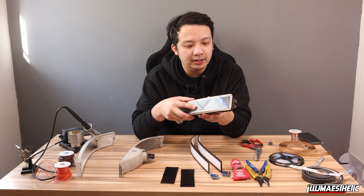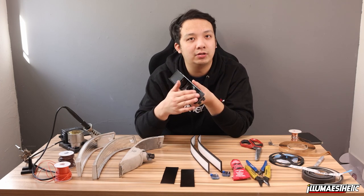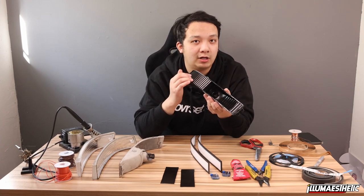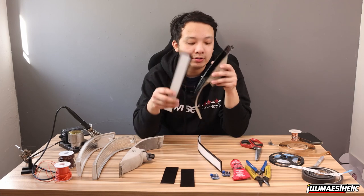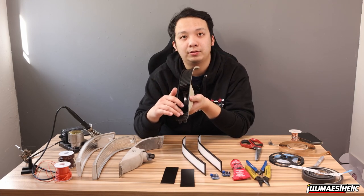I've already done the prep needed, and what is that? I basically scuffed down and removed all the chrome originally on this light. Reason being is that it is conductive and will cause issues if you don't remove it. It'll short circuit. I went ahead and also painted it black to match the panels, and also removed this orange reflector, cut some stuff and trimmed it.